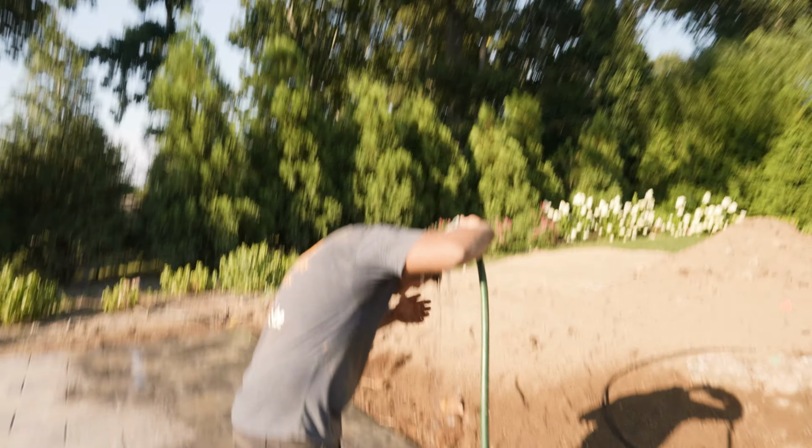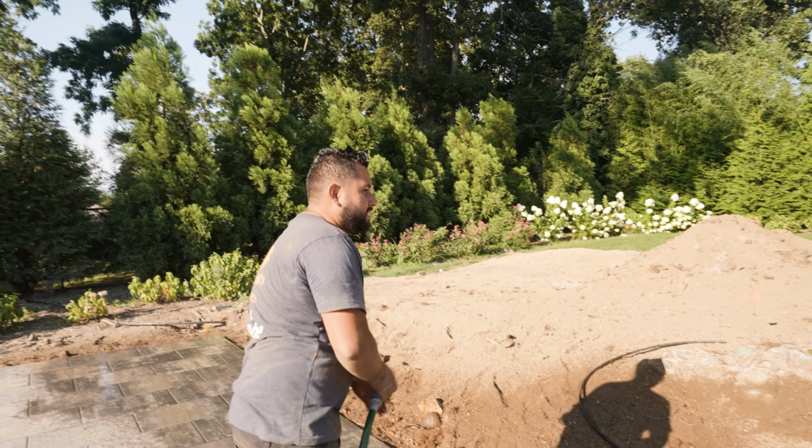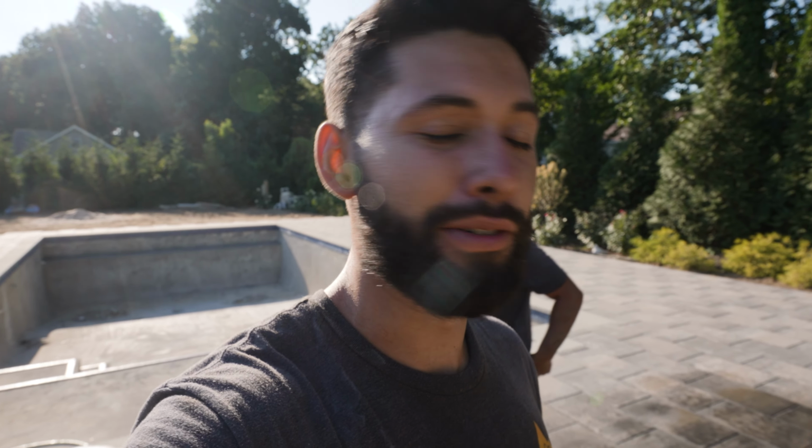As you can see over here, this is what we've been doing all day. Hosing our heads off with the hose water. But we finally completed this 6-foot pondless waterfall with some big boulders. We used more than double what we normally would use on just a regular 4 or 5 foot pondless waterfall, just using hand sized boulders. All these were set with machines and we used a bigger pump. The SLD 5 to 9,000, let me tell you, I think it came out amazing.